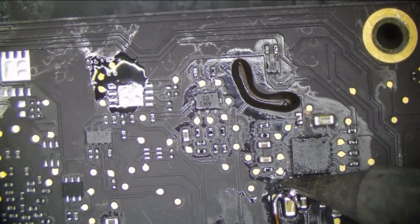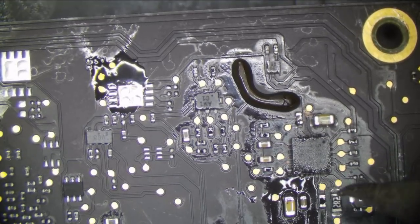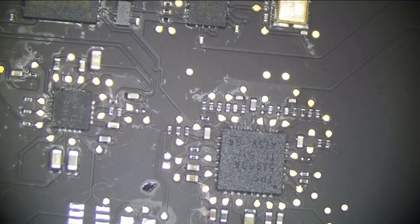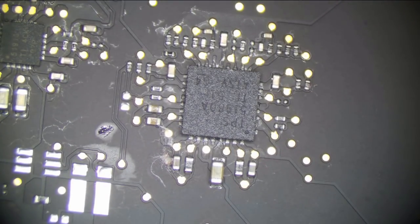So now we're at my least favorite part of this. Now we have to just start plucking stuff and see what it does. The first thing I'm going to pluck is the regulator for this chip, so that is going to be for this rail, PP5V_S4RS3. Yeah, I believe that this is going to be using U7501 for the output. Let's look here, so U7501.